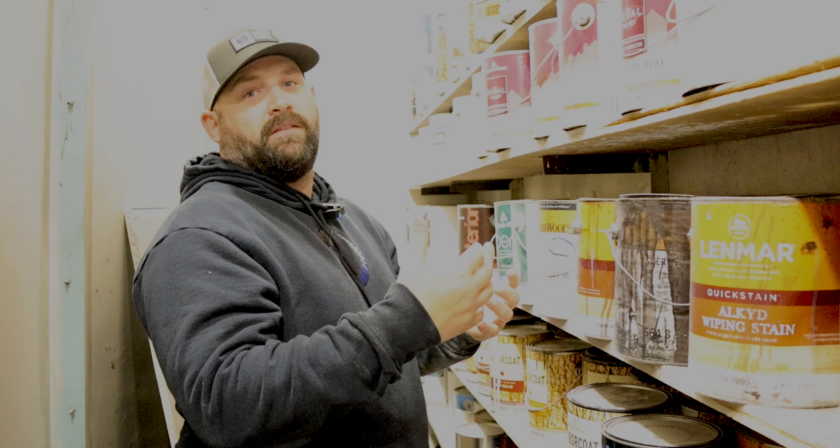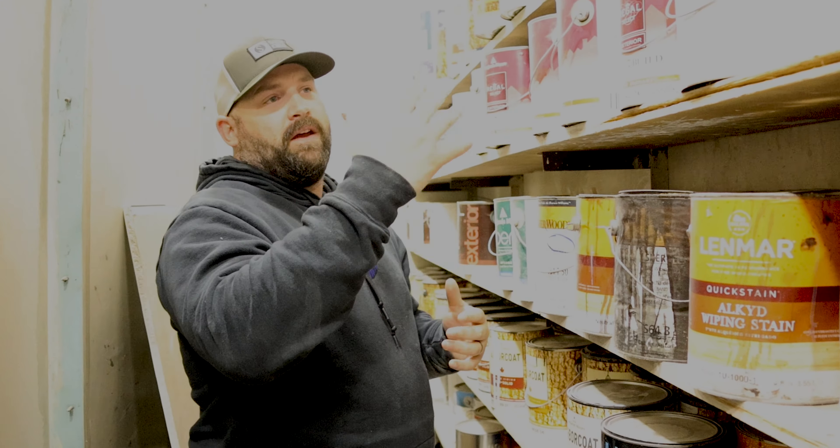It is gonna look shiny for a couple days and then it'll tone down after that. With the water-based stuff, it's gonna sit on top of the wood — it's basically like a paint, like you're painting wood. Around here we get hail and all kinds of weather. If you're in Southern California, water-based is a great option because you're not dealing with a lot of weather. But a water-based product will sit on top of the wood, and as soon as it starts to chip and get water underneath, you're gonna have to redo it — you'll have to sand it. If you're really looking for that wood cabin feel, you gotta go with oil.